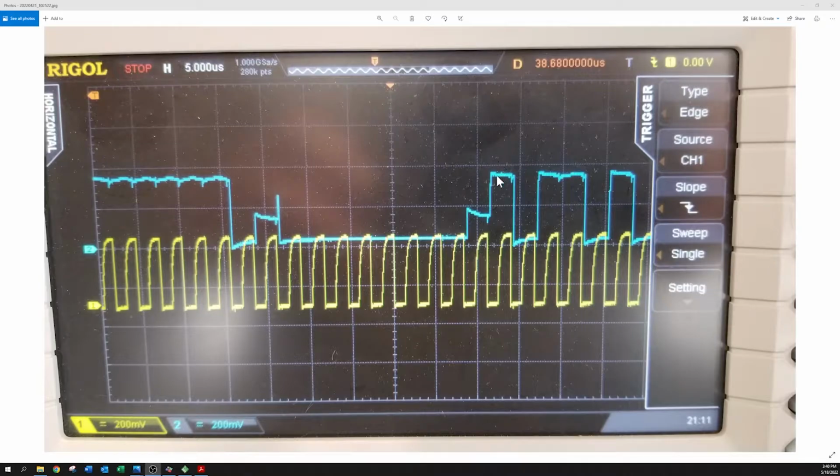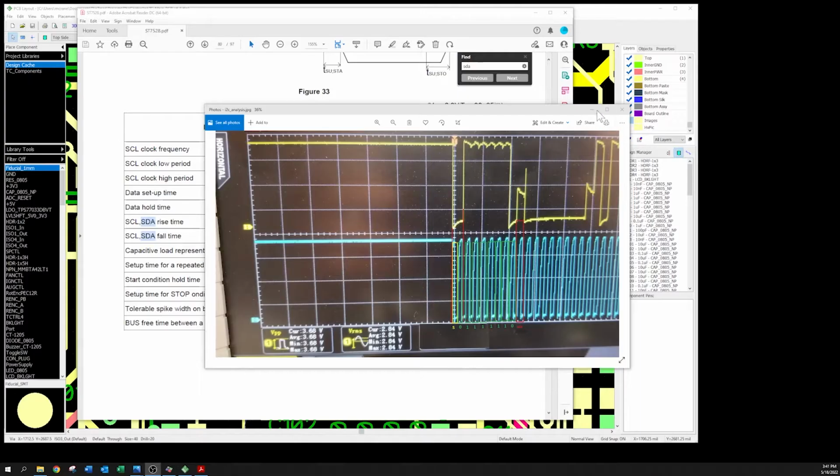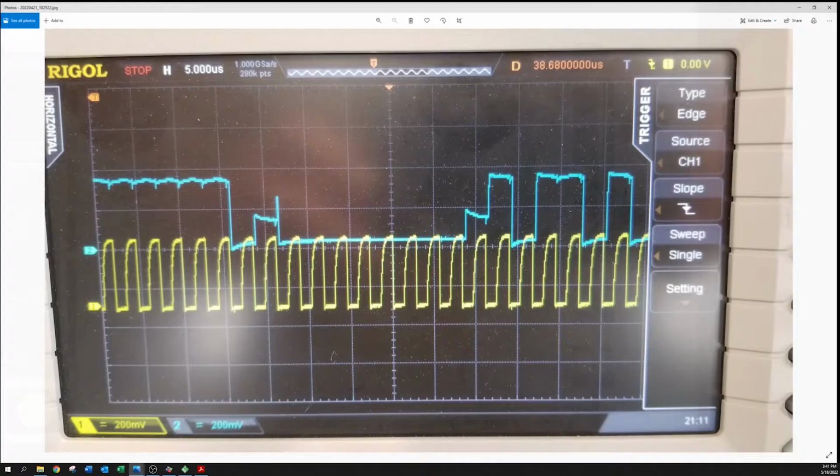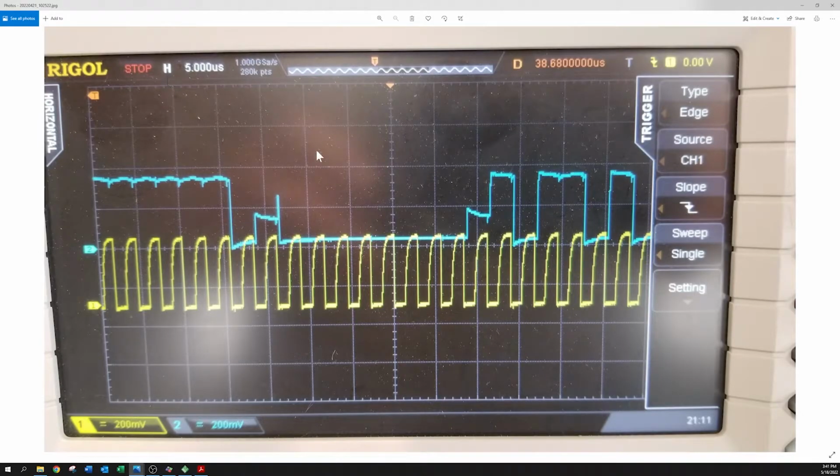So I was like, okay, the SDA line looks fine. Pulling it down, you can see the controller had no problems pulling it down, but the LCD couldn't pull it down, right? You can see a little bit of the curve on top of this pulse right there, but it just wasn't able to pull it down. And another thing I forgot to mention is I slowed it down. I went from 400 kilohertz to 100 kilohertz, and I didn't have any problems, other than it was slower than dirt. At 100 kilohertz, it would pull this down. It wasn't perfect, but it'd pull it down, somewhere around here. So it was able to pull it down.